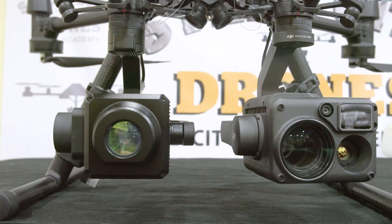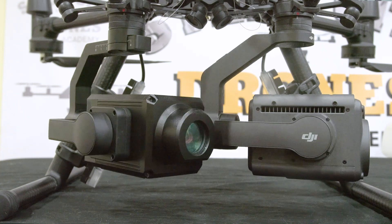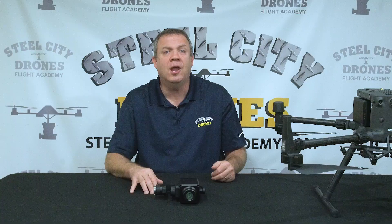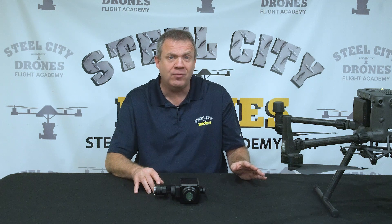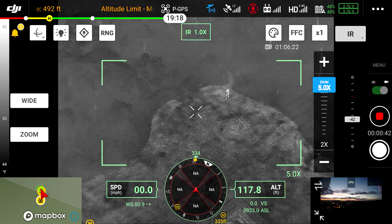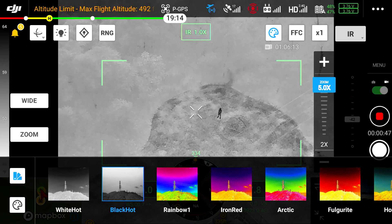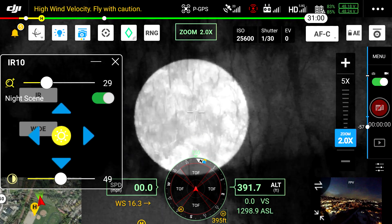There are some panning limitations — CZI programs an overall pan limit on this sensor so that it doesn't hit the H20 camera. I've gotten questions about whether it's possible to use this with the H20 camera instead of purchasing the more expensive H20T with thermal features. In my opinion, if you're trying to do search and rescue, you still really need the thermal technology, because we can assign temperature ranges to specific color palettes to help subjects stand out in contrast. The IR spotlight illuminates everything, and I feel it'll be easier to overlook someone, especially if they're trying to hide.